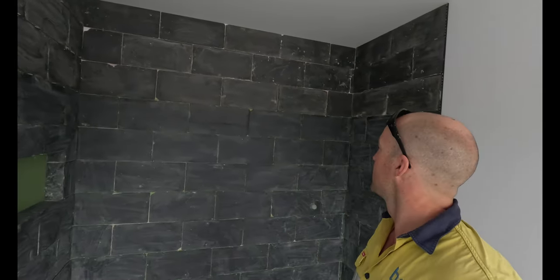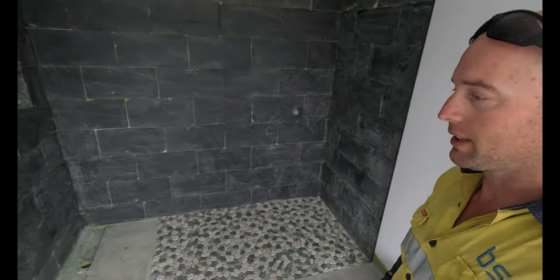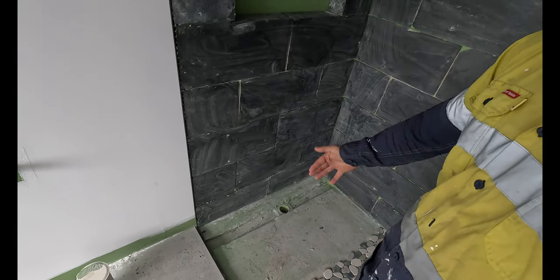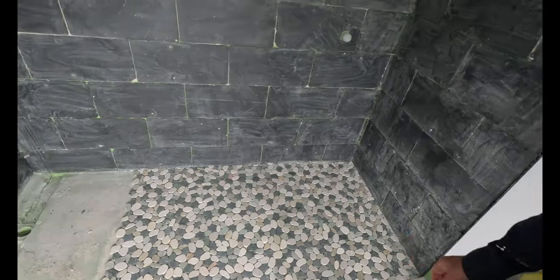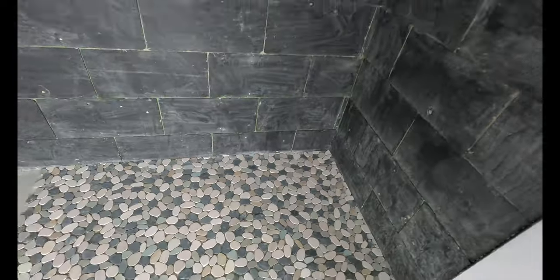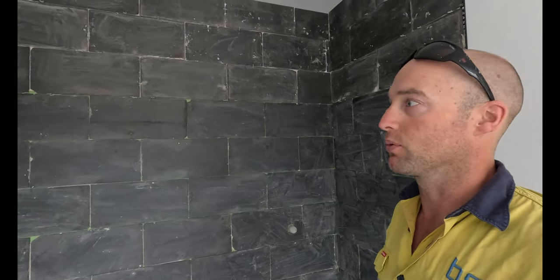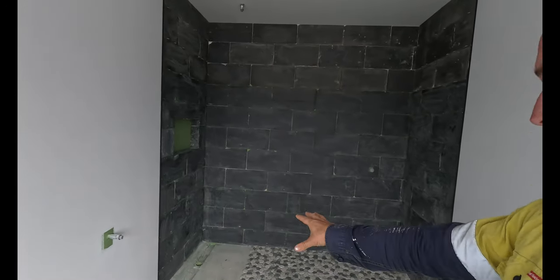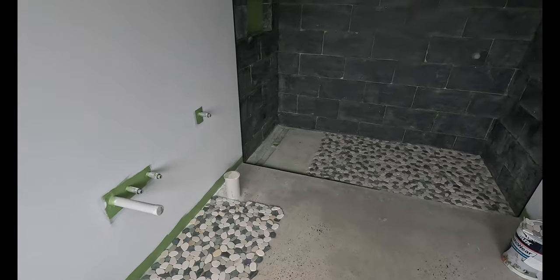Just like that, the ensuite shower is pretty much tiled. We're just waiting on the grate for the floor drain so I can get that mounted first and tile up to it. I didn't film putting the floor tiles in — I just got a bit distracted and wanted to get it done — but we went with the pebbles. None of them are sealed or cleaned off yet. The slates are still pretty dirty; they'll need a good couple of washes, then we slate-seal them and they come up really black and shiny. We've done it on a couple of previous bathrooms and they look really good. Once the grate is in, the pre-cut sheets are ready to go, then we can get the glass and our vanity and the bathroom's nearly done.